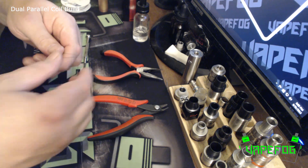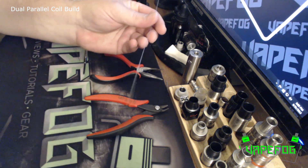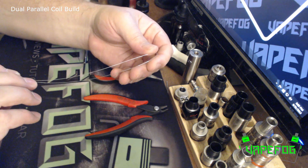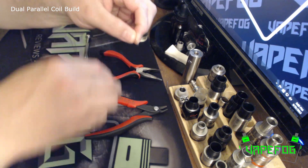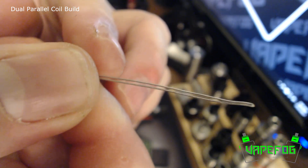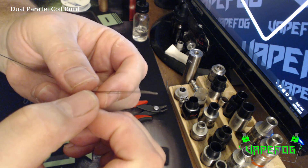I've got a piece right here and another piece which has already been folded in half to make our parallel coil. I straightened my Kanthal with the drill, then just fold the two ends together. Squeeze the two ends as small as you can get them and then with a pair of needle nose pliers mash these two ends together until it looks something like that. It doesn't have to be perfect because this end is going to get cut off anyway — we just want to make sure it's small enough to fit through the posts on the RDA.